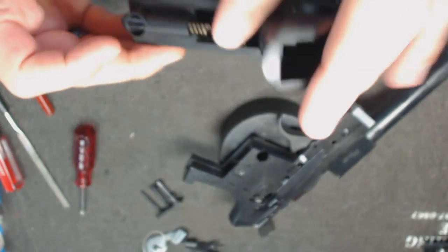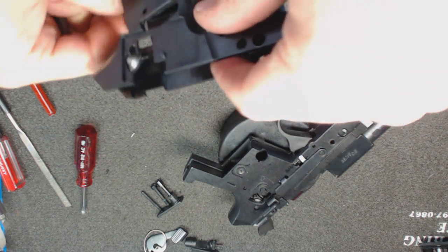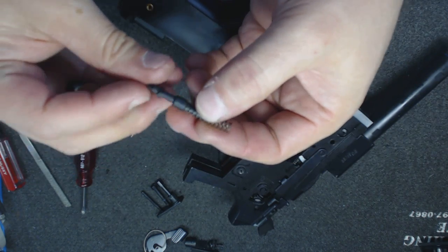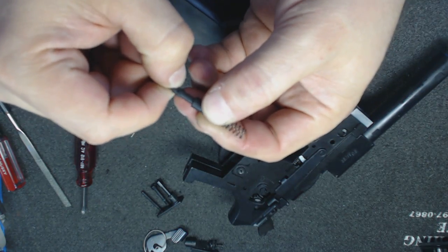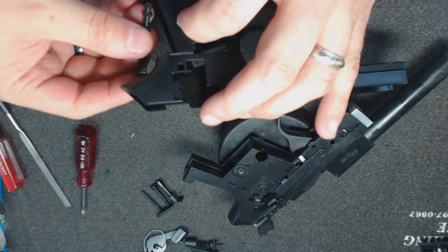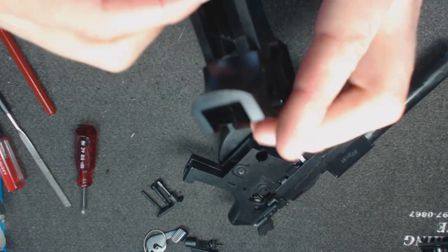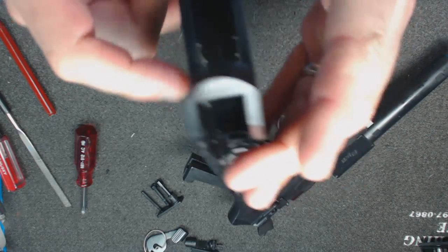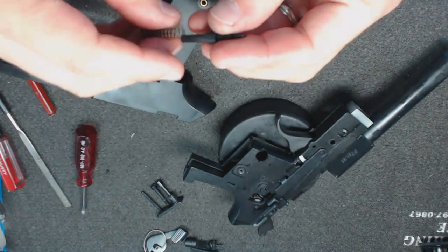That leaves behind this one last mechanism in the frame, which was that locking system that I was referring to. And so here you can get a sense of how that actually worked in there. Basically, the little end here is all that was exposed. If you pushed it up and then turned it, then these wings would get caught and not be able to drop down as far. So in, I believe, this position, that's going to leave that plastic sticking up just that far out of the frame, and that's enough to block the hammer from coming all the way down.